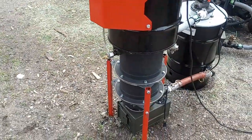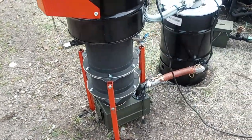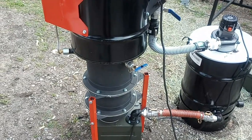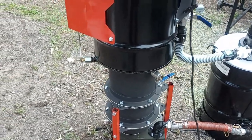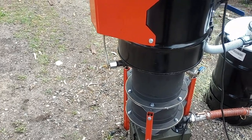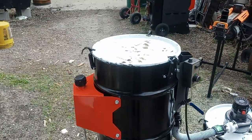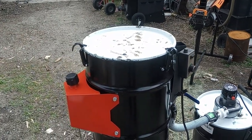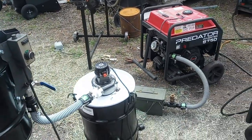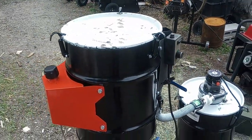There's really no point in doing temperatures because it's completely different — the two back secondary valves are shut off. So it's going to be a lot hotter at the primary jet. We changed some of the dynamics, so it needs to catch up and get re-established.